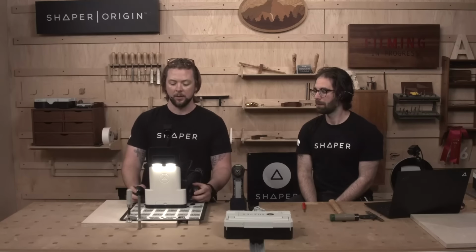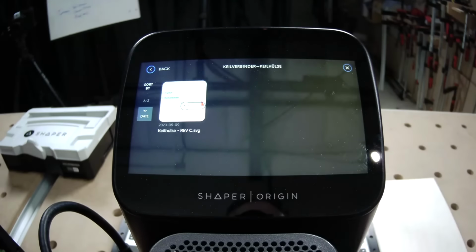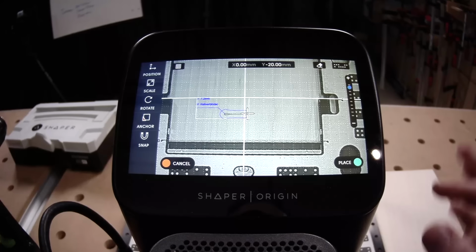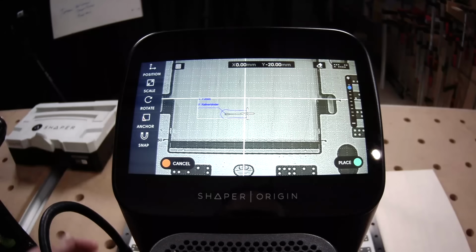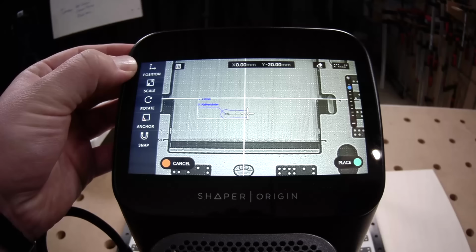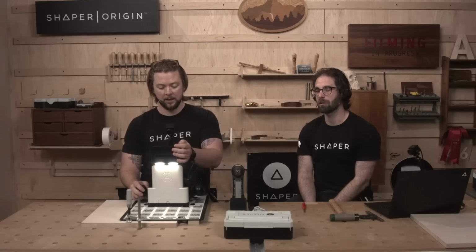Exactly. So if I bring Origin in, I can go ahead into import. Yeah, let's do the short one first. Grab the single. Yep, and now here's something that's important. We're going to place this centered in the X direction, which is going to give us a 70 millimeter spacing in from the edge. Now, from the distance of the front fence, we want a gap of 9.5 millimeters because that's the distance of our pilot hole locations from that edge drilling template that we have in the kit. Easy peasy. So we want to make sure those two things match up.